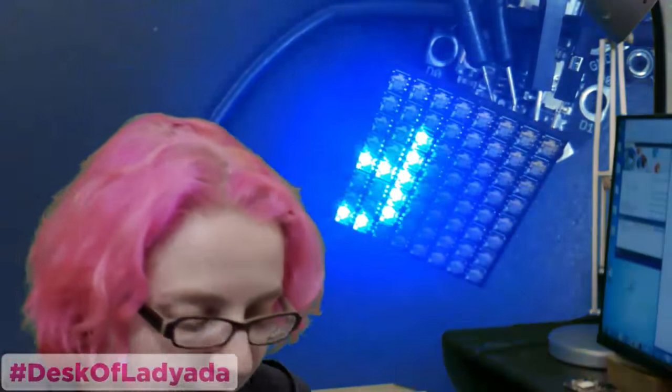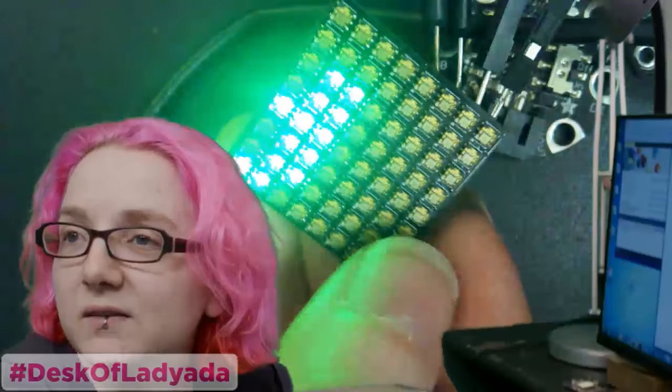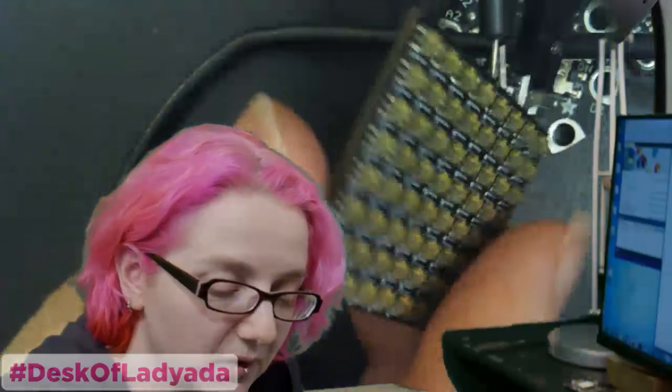Okay, so you can see. I like it. Even though the pixels aren't as diffuse — the nice thing about NeoPixels is that the epoxy lens really kind of blends the LED. These are a little more pointy, very point source-y, but I still like them. So that's demo number one. For this, instead of hand soldering, we laser cut a stencil, pasted it, placed the LEDs individually, and then put them through the oven. Hand soldering these is a total pain — I don't recommend it.